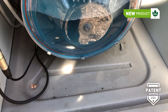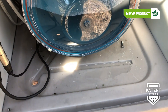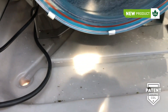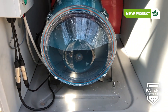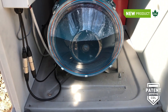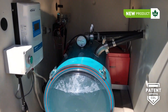One important detail: there's a drain at the bottom of this little cabin right here. That will avoid any water damage to components even if we open the cover of the lifter, and prevent the cabin from filling up with sap if something goes wrong. The sap just runs to the bottom and drains outside.